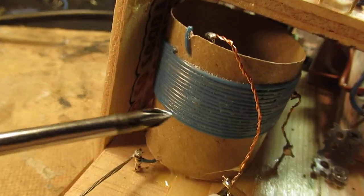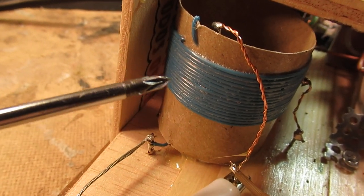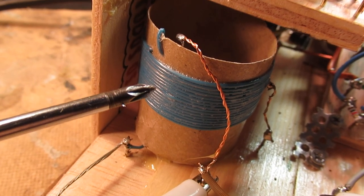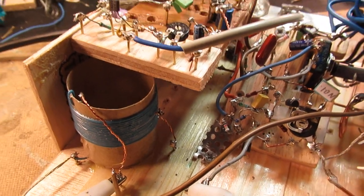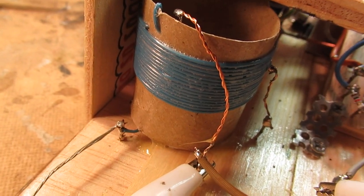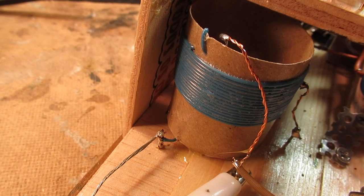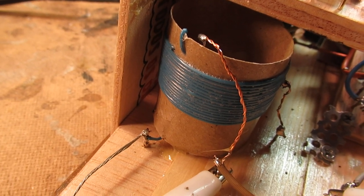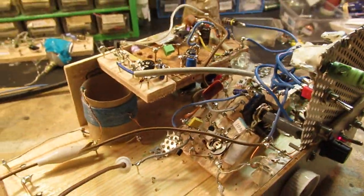Could be in the 10 picofarad range, but on the other hand, that plays a role when we are looking at the quality factor of the coil and the tuning. Anyway, this is a good way to make a shortwave coil for 2 megahertz up to approximately 12 megahertz. And then I mean the antenna coil, not the oscillator coil. Anyway, so let's listen again